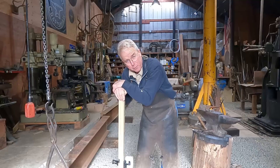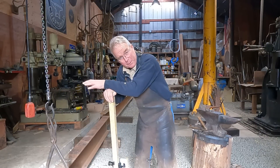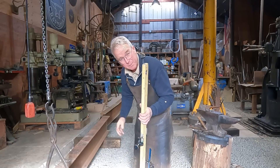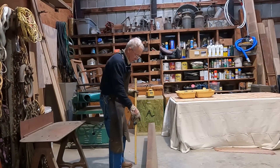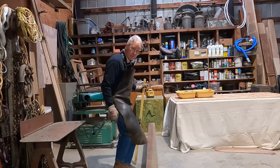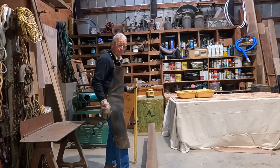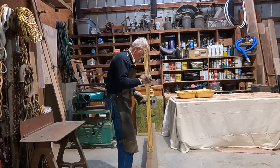Now that I'm confronting the reality of a gravel floor and needing to get a beam nice and straight, I'm going to have to play with this a little bit, but I think the laser will help me get it within maybe an eighth of an inch. I'm going to set a benchmark where this beam bears on this concrete on top of an inch and a half — it just gives me a little room to shim and fudge and play around. Let's see what I need to do to get this raised up an inch and a half.